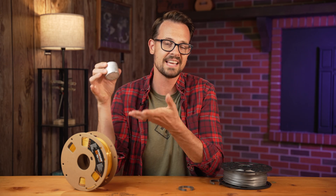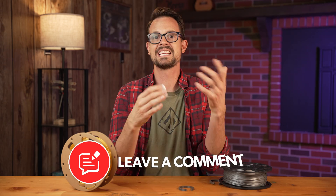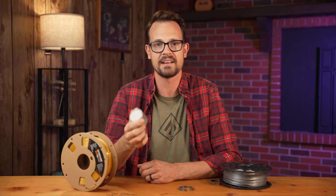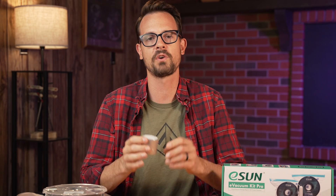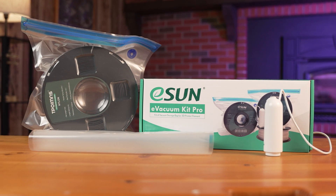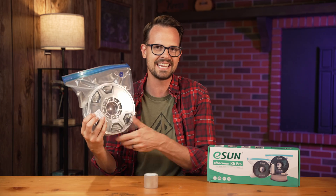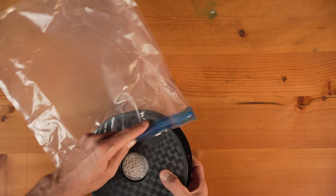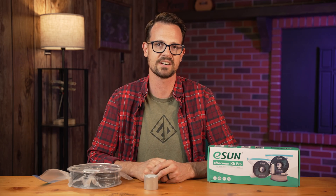There are probably a ton of ways to hold these in the center of your filament spools, so if you have any ideas let me know in the comments, especially if you design something — post it and link to it so everyone can benefit. Not only is this form factor great for active filament use, it's also ideal for long-term storage. I really like these eSun vacuum bags — not sponsored, but I've been using them for a while. It's a little hard to have loose desiccant in a bag, but with this you can just place it in the center before sealing, and you've got desiccant with your vacuum bag. This is really great for nylon and other hygroscopic materials.